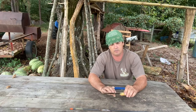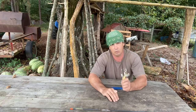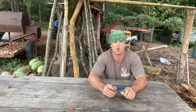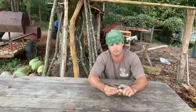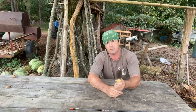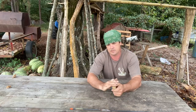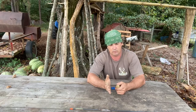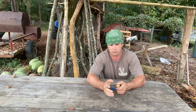What it does is it makes it so hard on the edge that it's hard to sharpen. But now once it is sharp, it will stay sharp for a while. But if you do any chopping, batoning, pieces of this blade will chip out. It's pretty hard. This blade is already tempered enough into the right steel that as I grind it and I cut it with that cutoff wheel, it burns that edge and it loses the temper right along that edge.